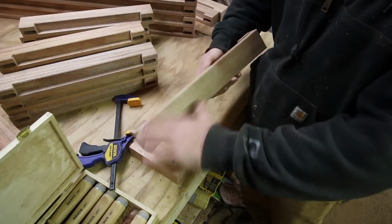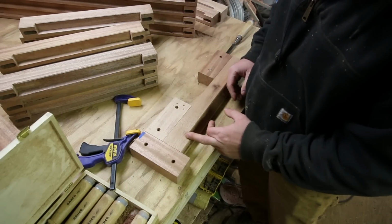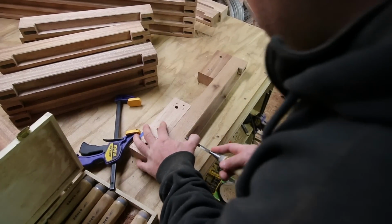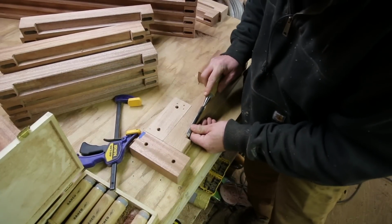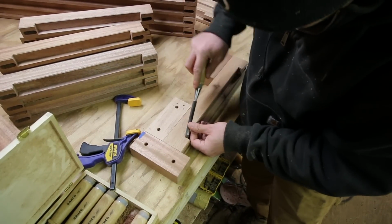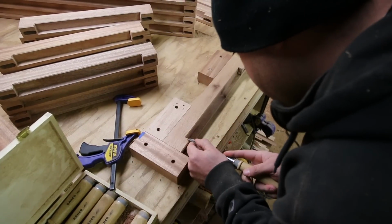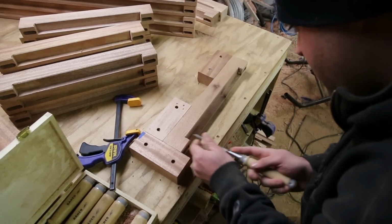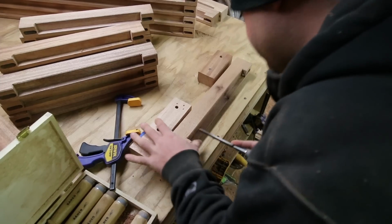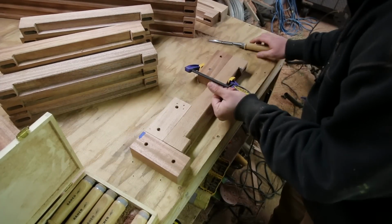So I've got that chamfer in all my pieces. Now in all the vertical pieces, I've got that radius to edge now. So I'm just going to come in with a chisel and cut in, and then hold it tight to this edge here and bring it to there, and then just clean it up. And then while I'm here, I'm going to clean any of these nasty cuts up, because these were pretty nasty. Probably should clamp it into place, shouldn't I? That's probably a good idea.